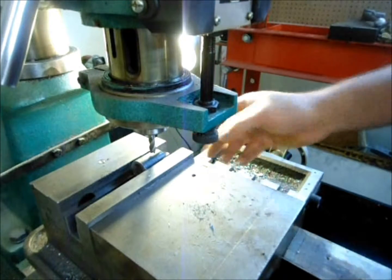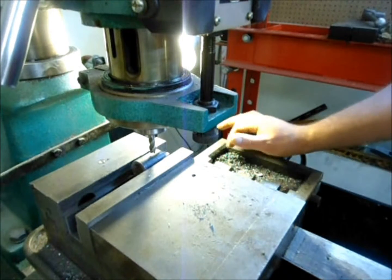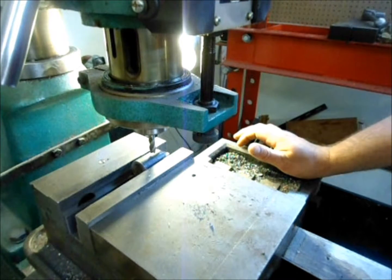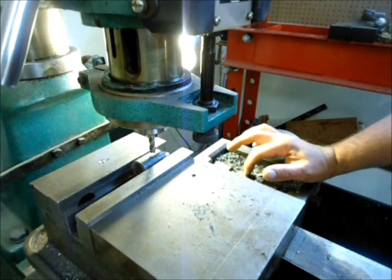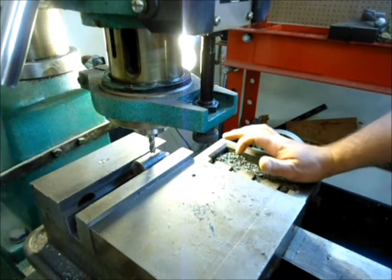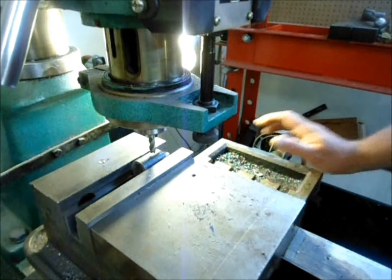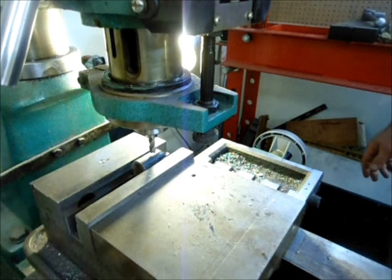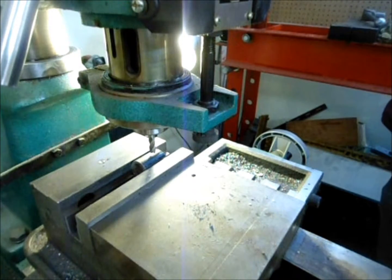I've got a couple of parallels supporting it because I need a 3/8 inch keyway, and I'm using a 5/16th inch end mill, which is what I had quickly available. It's actually better practice than using a 3/8 inch because that might wear down to a narrower diameter. But again, this is something you can really do with just a drill bit and a file — we're close enough.